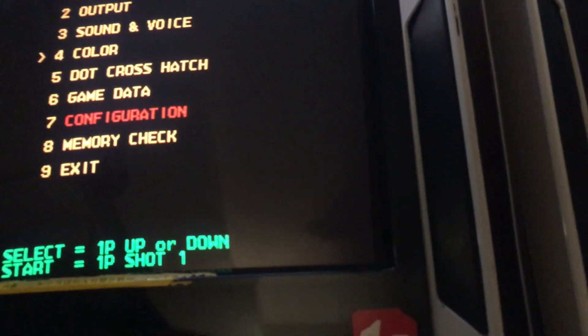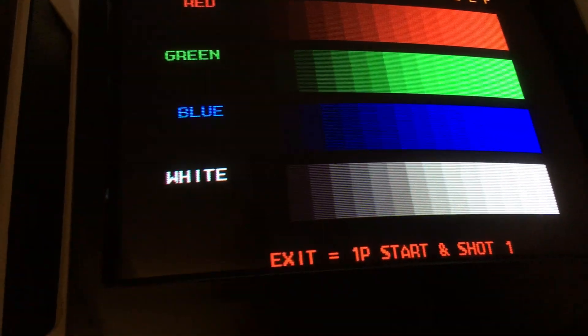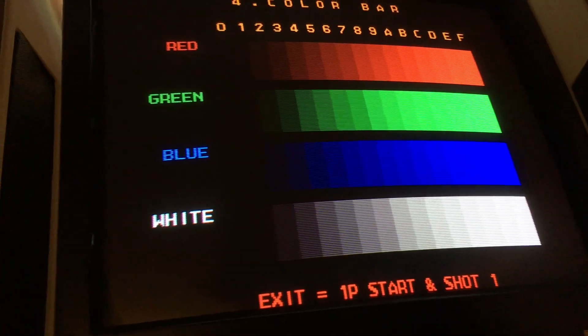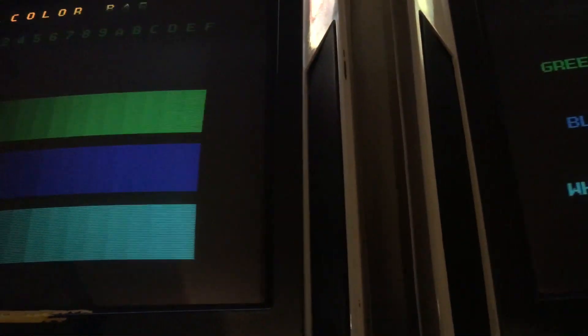As with Splitfire, and as always, the video splitting for these two is buffered, so unplugging and plugging Player 2's side does not change the brightness of Player 1. Connector A, the first one, happens to carry the video. So with it disconnected, you can see it only on Player 1. This is a kind of shitty video test just to show that it shouldn't change on Player 1's side at all when I plug it in. I think it's going to be pretty flexible. This means cabinets don't have to be impedance matched — a friend with a Neo Geo versus setup has two different monitors between the two cabs, and when they're split passively, one monitor gets a lot darker and fuzzier because of impedance differences. This isolates that and makes it much more compatible.